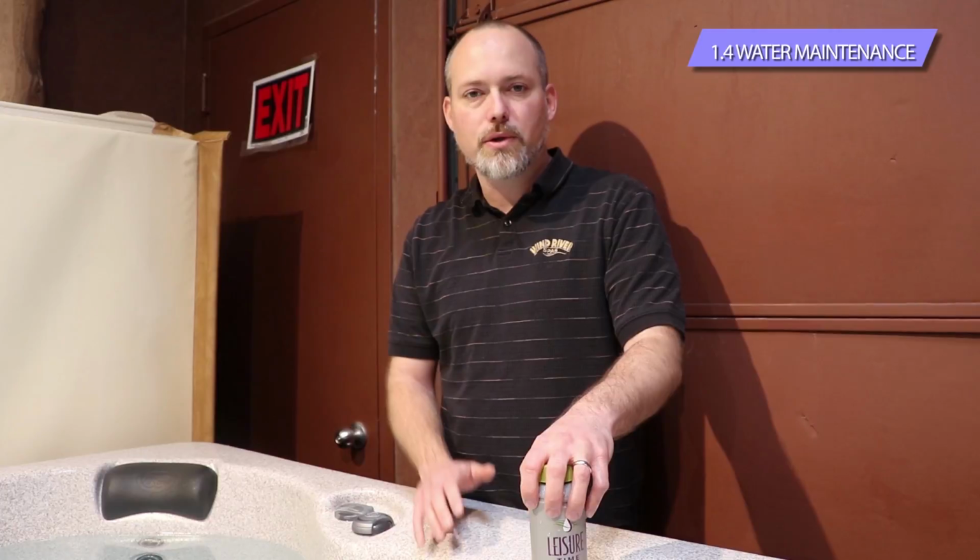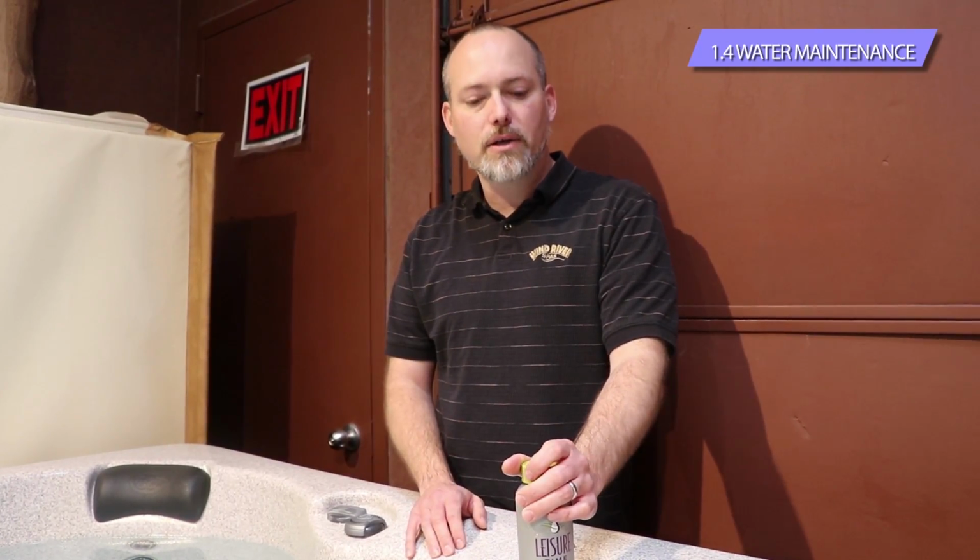To drain the tub, first thing first, always turn the power off. This time you're not going to use the hold cycle for the power because it's going to take you longer than an hour to drain the tub and fill it back up. So turn the power off at the breaker, wherever your electrician located it at. Hopefully you know. If you can't find it, call us and let us know. We'll see if we can help you locate it.